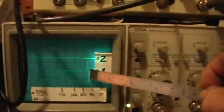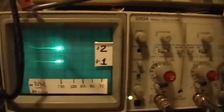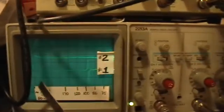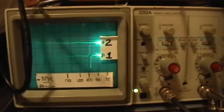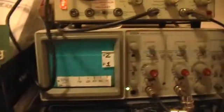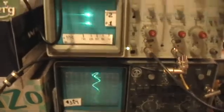This pulse is coming from the coil. The top trace, which is triggering the scan, is the pulse coming from the ratiometric Hall effect sensor on the other side of the disk. So this spacing between the trigger and this peak represents half of one rotation. We're approaching 100 RPM right now, and I know with this arrangement that we'll top out at about 170 RPM. Curiously, that's just what Milo reported — 170 RPM.